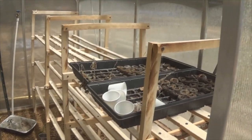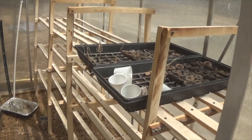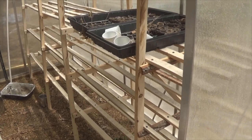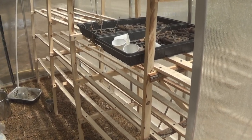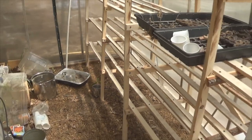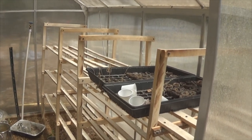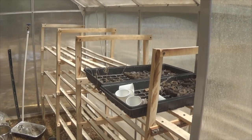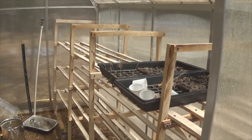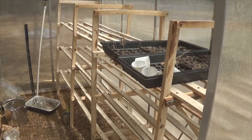To recap — this is what was left over of the tree that I cut down in order to build the saddle rack supports, the boards. The slats are half-inch sweet gum; the supports are one-by-ones and they're cut fairly close. Now there's a little bit of warping — you can see that one pretty clearly how it's warped — but not a big deal; the screw will hold it, and if I get concerned about it, I can put a block underneath it. All in all, I'm pretty happy with it. The cost for this was my time and a little bit of gasoline and the screws. The gasoline was cheap because I was able to cut so many at a time with my sawmill. The screws are left over from years ago. Life is good. Dysfunctional Vet, out.